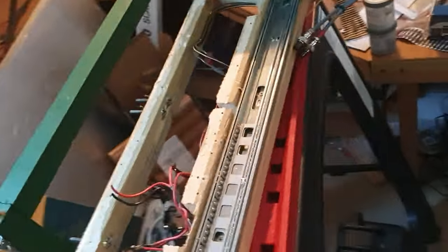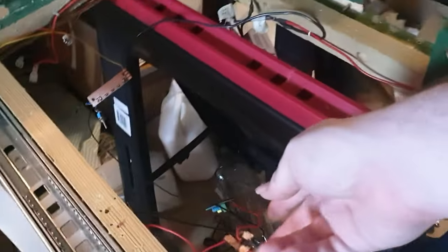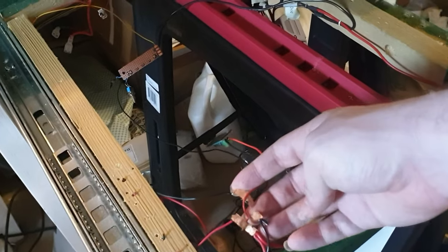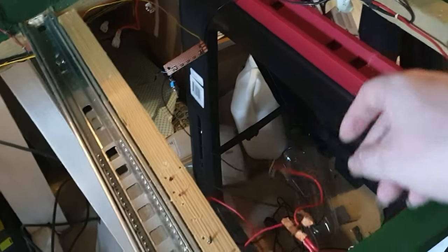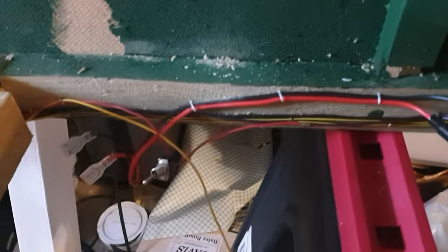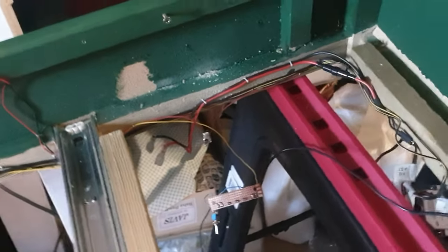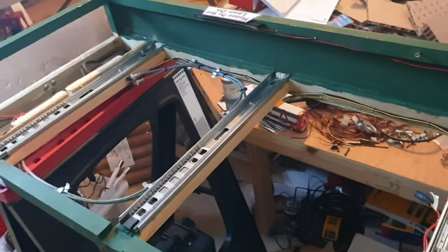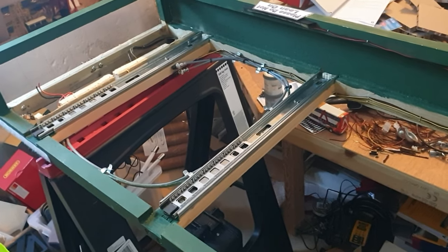Gonna need to redo some of the cabling on this panel. I haven't really been under it since I initially built it. Over here, bit where we had some copper tape holding bits on, that's broke, got to redo that. Got our surge protector from DCC Concepts. And then we've got the little circuit board that does the ADCC. And an extra switch which does our yard lighting. And those two little plugs there went to the 12 volt outlets. All disconnected now. So now the job is just to put a new surface on, I guess, and then rewire everything up and set it all back up again.